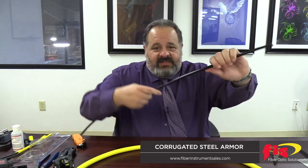It's a great use for an outdoor cable. You can see it's black — that's your UV-resistant outer jacket — so we can run this aerial or we can bury it. An important thing to remember on anything you bury: find out what your local frost lines are. Those of you in Florida or Nevada won't have to worry, but those of us in cold weather areas want to make sure the fiber is buried below the frost line.